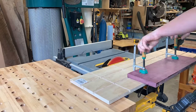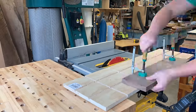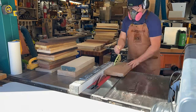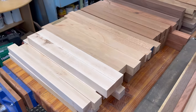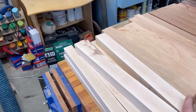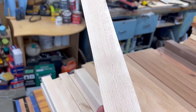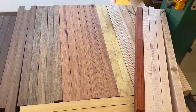You can also use a straight-line jig — some match fit clamps make a really simple sled — to help get edges jointed. Once you have a pretty straight edge, run it through your table saw. I'm running all these at one and a half inches wide for edge grain boards. I cut the pieces at one and a half inches thick, then rotate 90 degrees so the edge faces up — that's better for knife marks and holds up better. All these pieces are cut at one and a half inches for the eventual glue-ups.